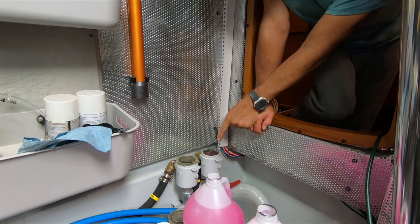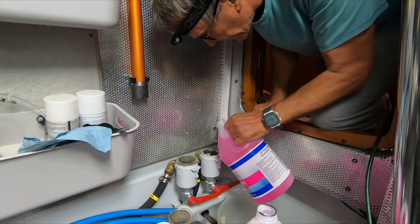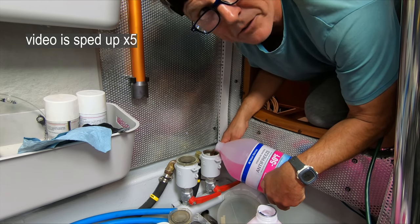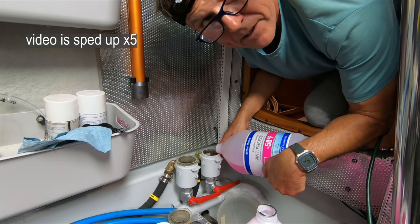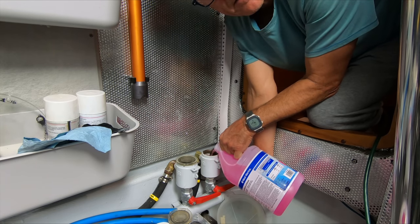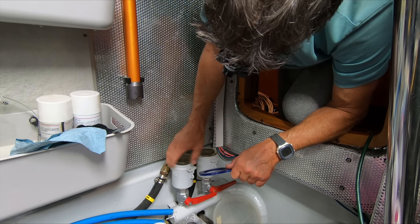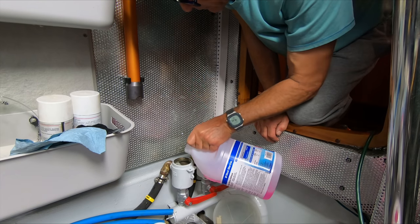Next job, air conditioning. It's not as fast as the main engine impeller. Pink water is coming through — it's going to take quite a lot of antifreeze because the piping runs a long way up into the saloon. You've either got to take your mast down, get into a nice warm shed and pay someone big bucks, or you've got to winterise everything yourself. For the deck wash pump, I've got the impeller out at the moment, so I'll just pour enough antifreeze to go down the hose.